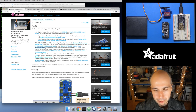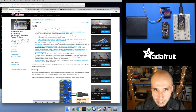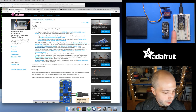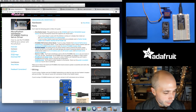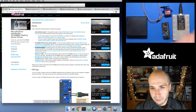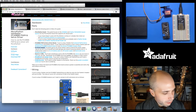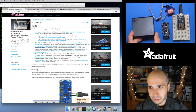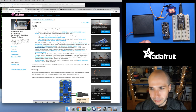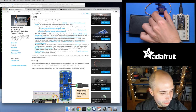You'll also need some kind of five-volt power supply. With these PCA9685 boards they have a little terminal block where you can plug in power so that when you're powering servos, you're not trying to use the five-volt power from your board — some boards like the feathers don't actually run on five volts. In general when you're powering servos, even tiny ones, if they get stuck their DC motors can pull a decent amount of current and damage your board. I like to use something like a four double-A battery pack, which gives you about five and a half volts — that's fine for powering servos.